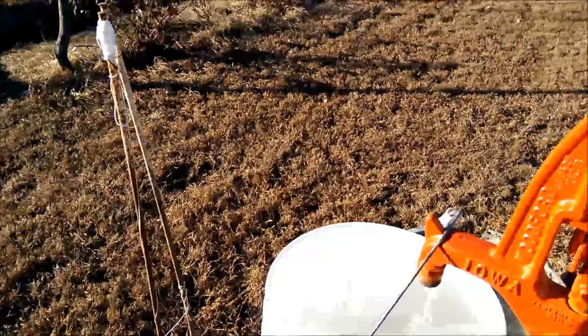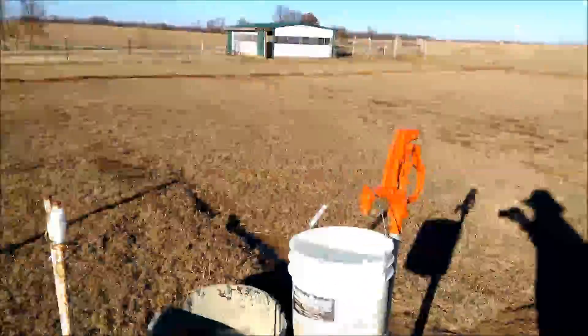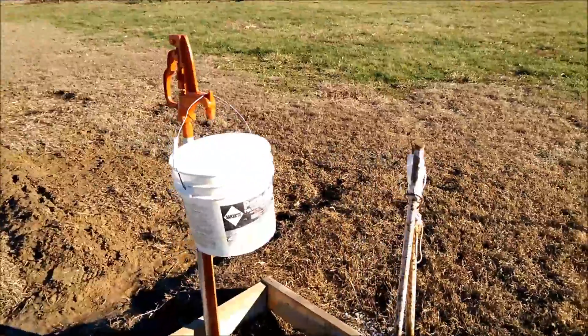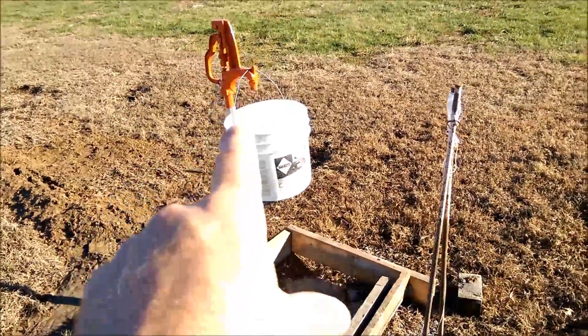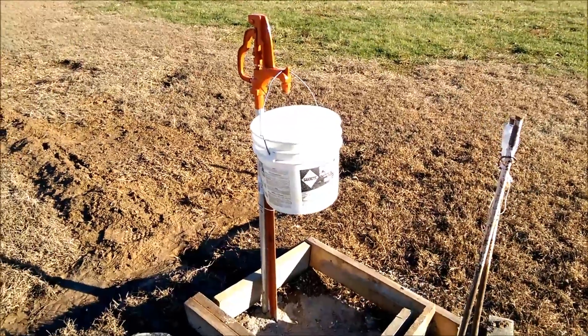No solar power, no pumps — not a single luxury. All gravity-fed. I showed you the weep hole at the bottom: because we're in a cold climate, as soon as you shut this lever there's a weep hole in the ground three feet down and all the water drains out of this pipe, so you don't have any freezing problems. Now let's go look at the other hydrant.